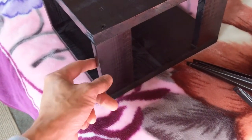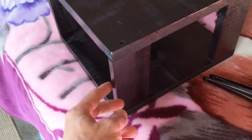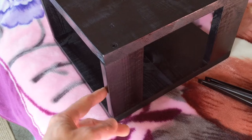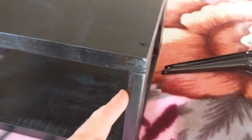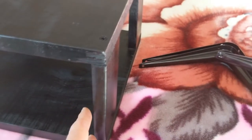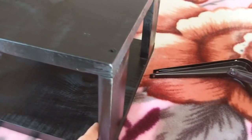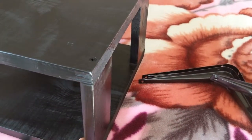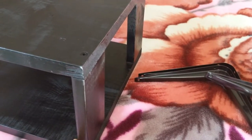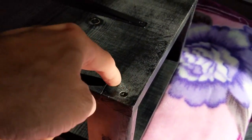And then I just took these little pieces of board, about two by one or a half - I think this is three-quarter inch too - and I cut these into five and a half inch lengths. Just rip my table saw, four for each one, and then I put these on top of each other.